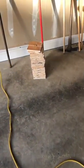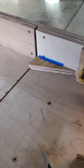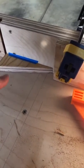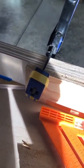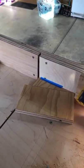I've got all my pieces cut and I'm ready to cut the angle pieces for the sides. What I did was cut an angle piece by hand, then used two pieces of painter's tape and super glue to attach that to the fence of my sled. I've got a little stop block so the piece slides in and I make the cuts — I should be able to whip through those pretty quick. Everything's cut; I just need to pre-drill, screw in the wood screws, and then we'll get them on the wall.